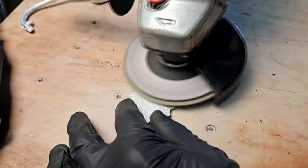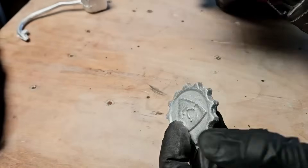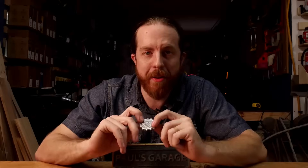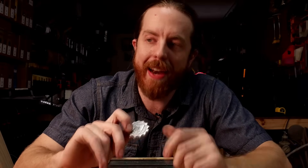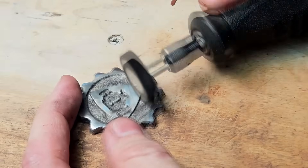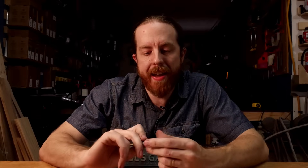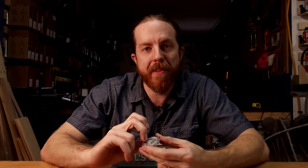When it comes to finishing, you can finish this like any other metal part, because that's exactly what it is — it's solid metal now, not painted or plated, solid all the way through. It's perfect for powder coating, laser engraving, or polishing, which is what I'm going to do. When you have a raised surface and a lower surface, large sanding tools tend to hit all the raised surfaces while the lower areas are left untouched. If you want to polish up in there you need small bits for a Dremel and the patience of a jeweler. Or you can paint the part first and then sand — you'll sand the raised surfaces clean and the lower surfaces will stay painted, giving you a stark contrast.